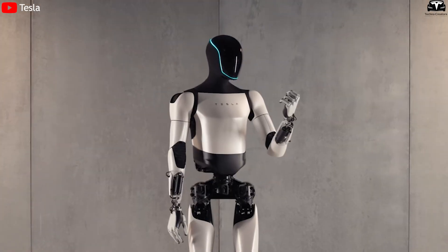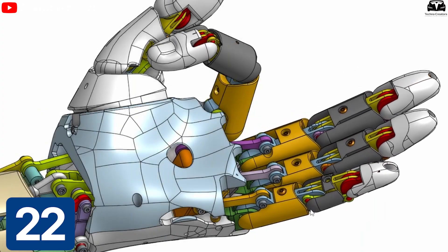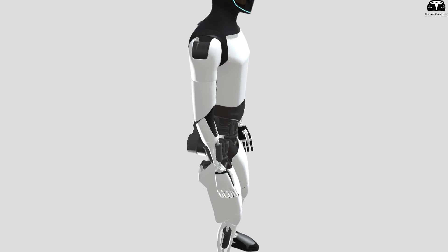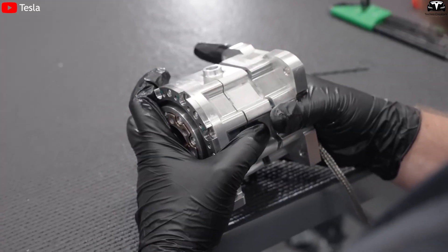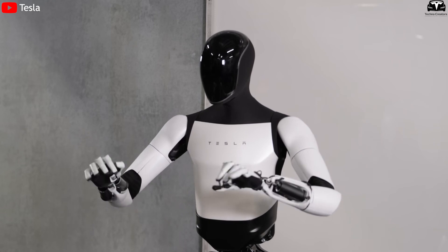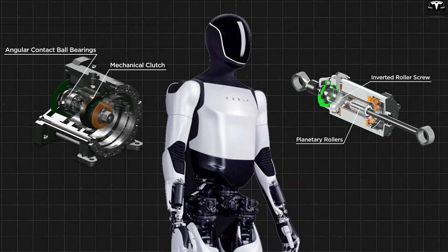The brand new design of TeslaBot Gen 3 is not just a minor upgrade — it represents a significant leap in the world of humanoid robotics. With 22 degrees of freedom, this new version is refined enough to play the piano and powerful enough to handle heavy-duty tasks. One standout change lies in the shoulder arm system: instead of the traditional dual-hinged design, Gen 3 adopts a ball-and-socket structure integrated with a harmonic drive, providing three seamless degrees of freedom and allowing the arm to reach into tight spaces from nearly any angle.